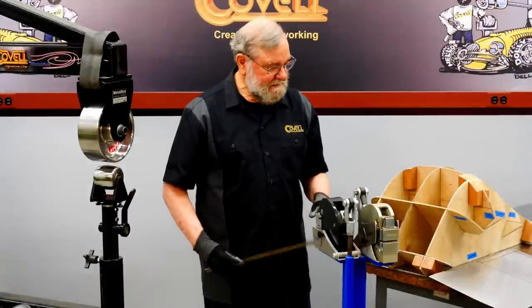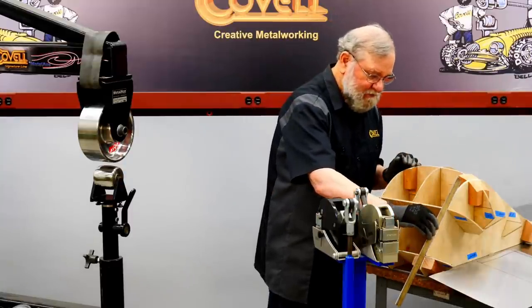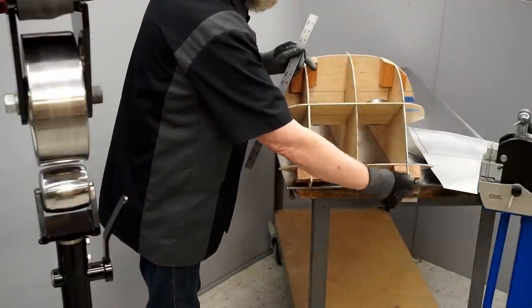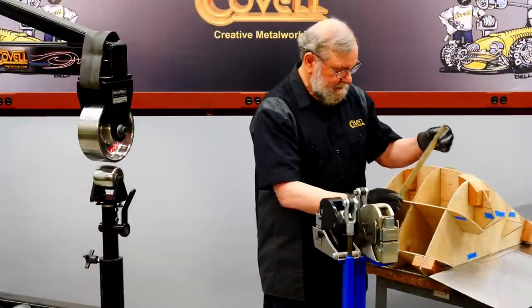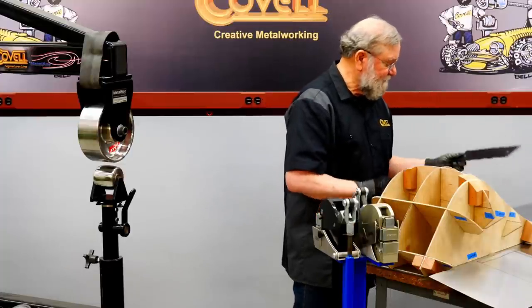we're going with this. If you look closely at the buck, you can see that it's basically pretty flat right here and pretty flat here. So what I'm saying is that the front half of this doesn't really need much shape at all, and pretty much all of the action is near the back. And we need to know what radius we're shooting for in the back.